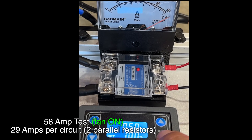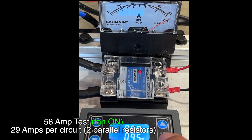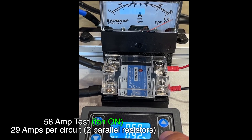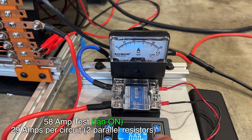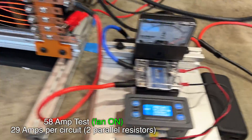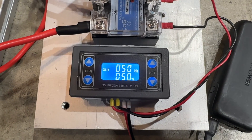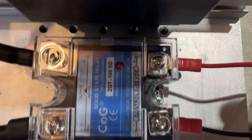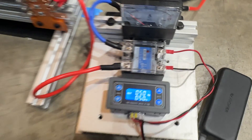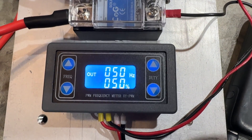Playing back in slow motion, we can see the instant that the solid state relay dies. As I'm turning the current down, you can see the current decrease on the ammeter, and then all of a sudden the light turns off on the solid state relay and the gauge is pegged again. It looks like our solid state relay is dead — we're feeding it a pulse signal but the red light's not blinking. IGBTs typically fail in a short circuit, which is what we're seeing here. The original goal was to pull 30 amps to test a battery, and we were pulling 58 amps, which is almost 2.5 kilowatts. I am disappointed that my 100 amp switch died at only 60 amps.